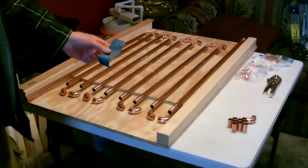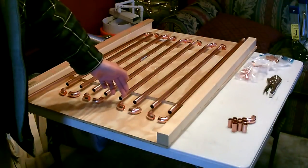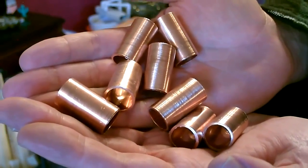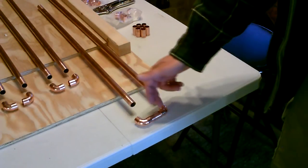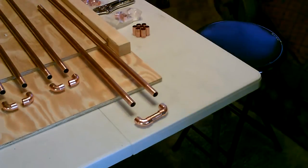First, take a little piece of 120-grit abrasive cloth and shine the end of each pipe. Okay, now time to solder — just add the flux here, here, here, and here, a little bit on here, push this together, put it on there, and fire it up.